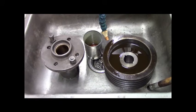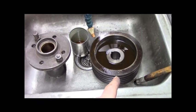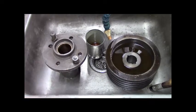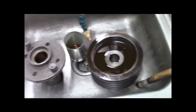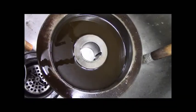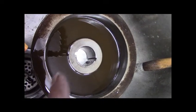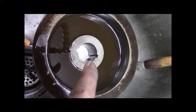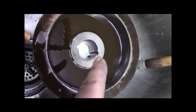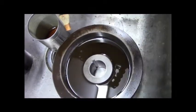A little micro update from Doozershop. I got the pulley from the headstock cleaning in the parts washer sink, and that's the brake hub. I got the seal out. Kind of interesting — you might notice somebody has broached another keyway. You can see damage at the bottom, so sometime this thing got tweaked a little bit and then someone abandoned that keyway and broached a new one. That's kind of neat.